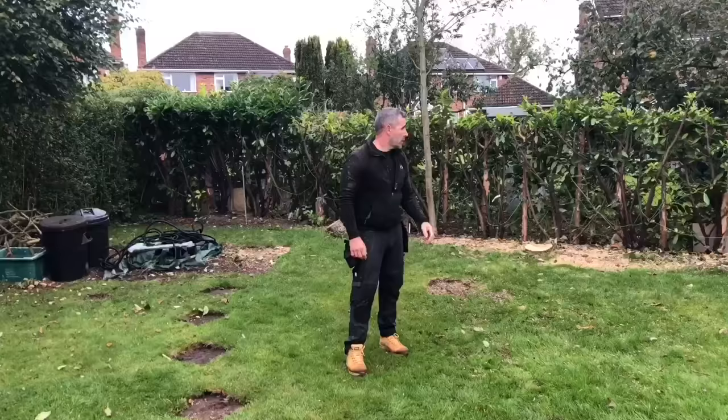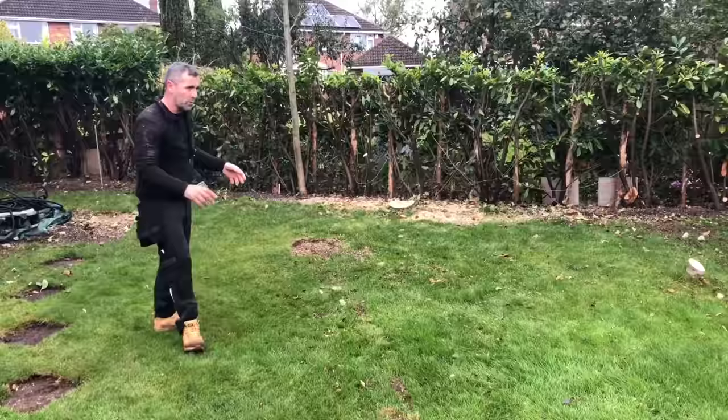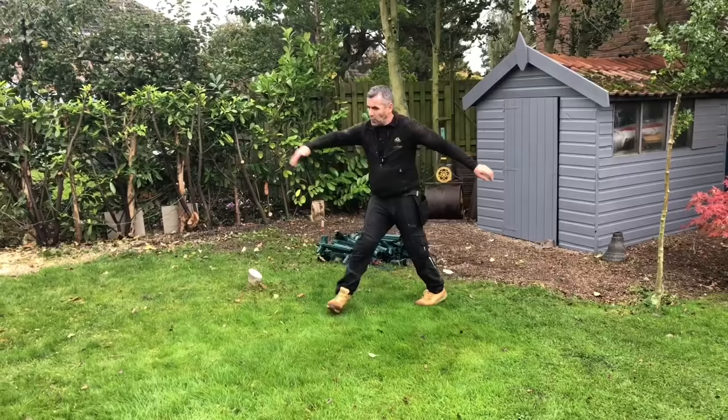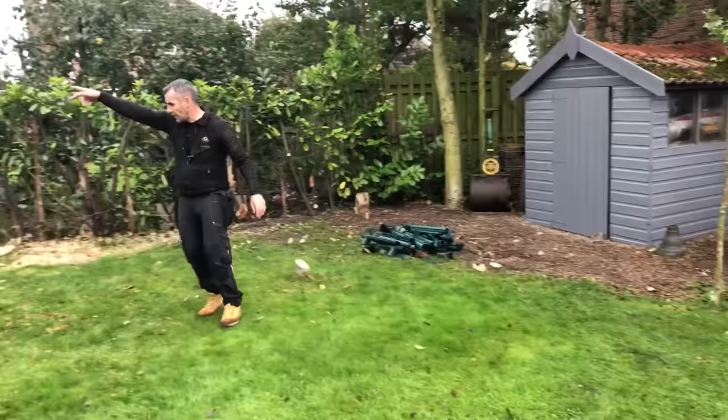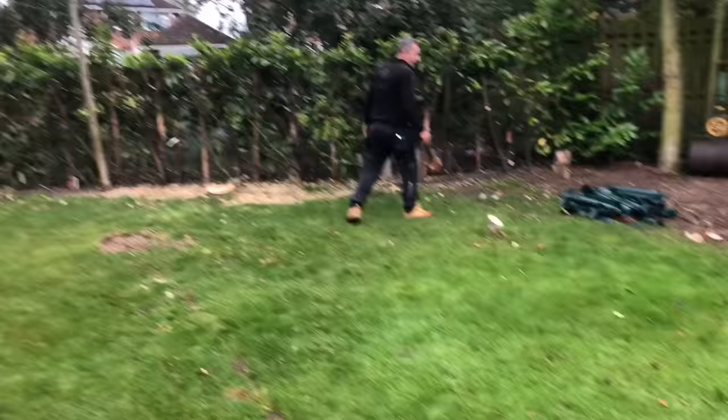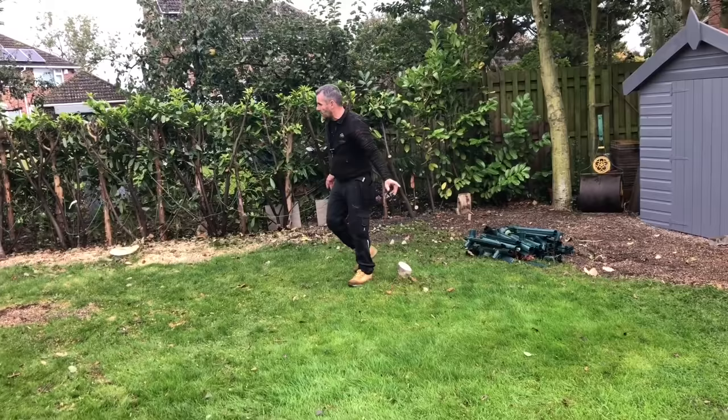Now the area's cleared. Like I said before, it's 5 metres by 3.5 deep, so we're gonna have everything in this. We're gonna have double roof joists, we're gonna have a steel over as doors, we're gonna have 3 metre bifolds. This will be the front corner. We'll have 5 metres going across over here. It will stop over here. The bifold doors will all slide that way. On this side we've got a window, like I said, window elevation. All these laurels are coming out. We're gonna put a fence in there as well. And round the perimeter we're gonna have a gravel bed, and I'll tell you why in a minute. At the front we're gonna have some composite decking with a gravel bed around.